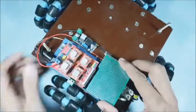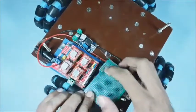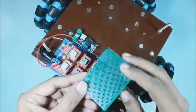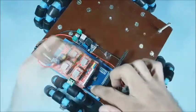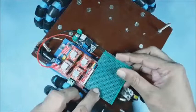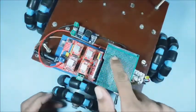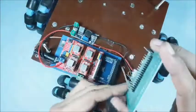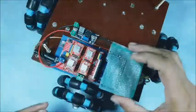Here a suitable double-sided PCB is used to access the free pins of the Arduino Mega board. A double row berg strip is used for end pins, and single row berg strips for side pins. Then place the PCB above the pins with berg strips and solder them as shown. Now we can access the pins of the Arduino Mega using berg strip pins on the PCB conveniently.